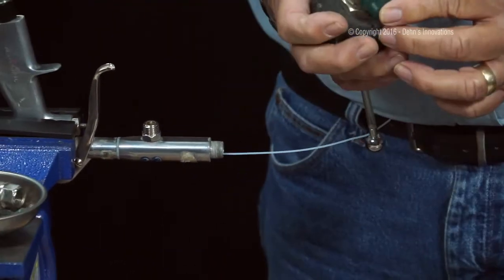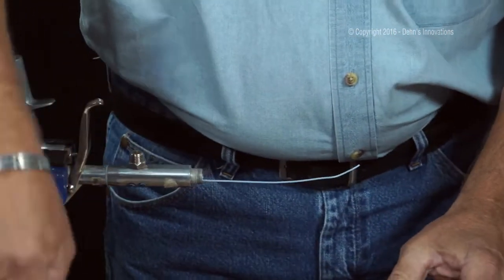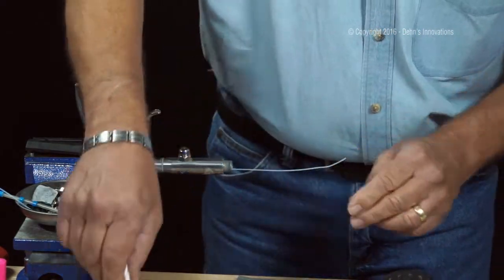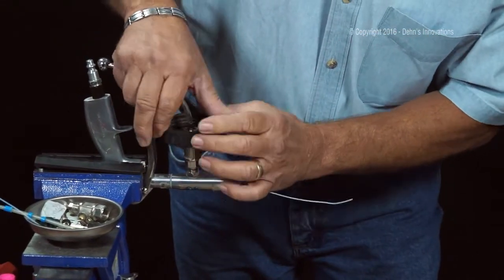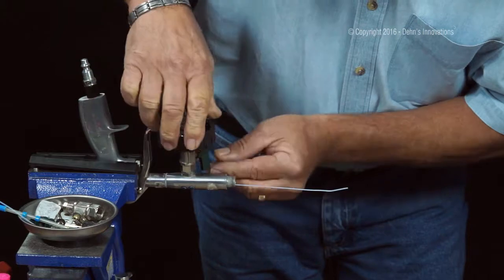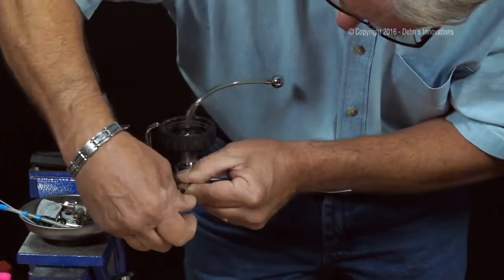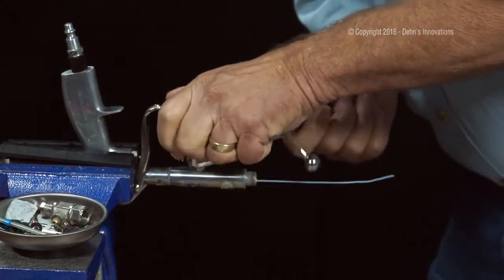Okay, now I'm going to take my air reverse switch. You don't need to put any thread tape on here. If you want to use thread locker, you can use a very small amount, and that's about it right there. This is 75-pound torque thread locker. That means I need 75 pounds torque to break it loose. I can take this and turn it around, and when it gets snug, I can either leave it, but I want it to be a little bit tighter, so I'm going to take my wrench here, and we're going to bring this around, get over here, and snug it down.